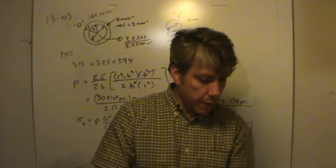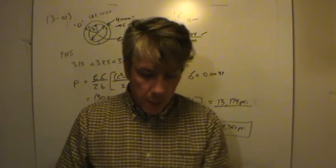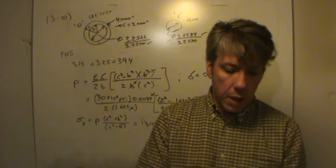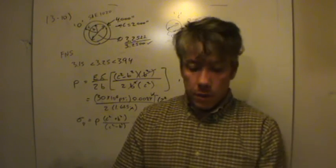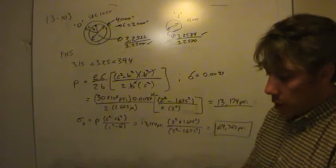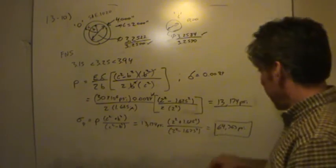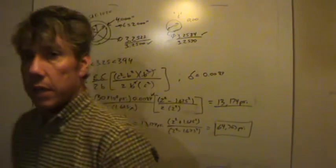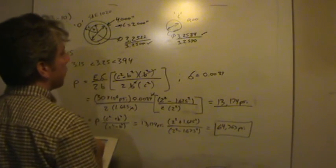Here we are. Okay, page 725 in the appendices, appendix 3. It has material designation number, the SAE number. The first 3 are 1020, and hot rolled is the first. Well, notice that the yield strength is 30 ksi, so this is way above that. It's definitely going to yield. But notice that the tensile strength, the ultimate strength of this material, is only 55 ksi. The 64 ksi will definitely break the sleeve. So we can tell that this design will not work if we have 8.4 thousandths of interference.